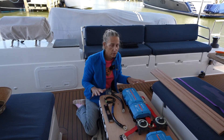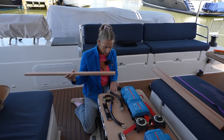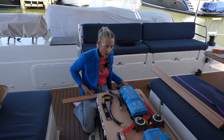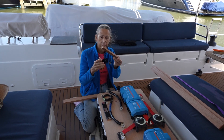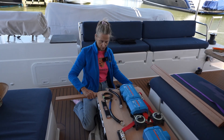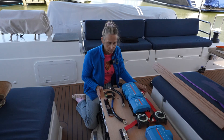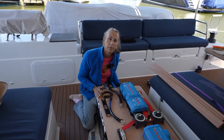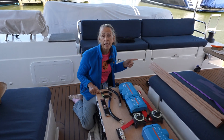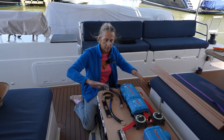At this point I don't have a lot of work left on the table or connections. One thing I do need to do is I bought some mahogany — three-quarter inch mahogany. The spacing of the table up off the batteries is exactly three-quarters of an inch, so I bought some extra wood. I have little spacers that are under here, just a little block for now. I need to cut them and mount them to the bottom so they can sit on top of the batteries properly. Once those are on, the table can be sanded and then painted with white bilge paint — completely sealed from the elements, because it lives in the engine bay. You don't want this thing getting wet or water coming in the edges and expanding.